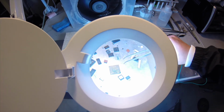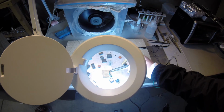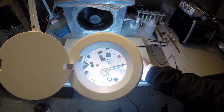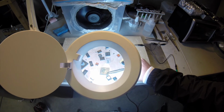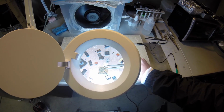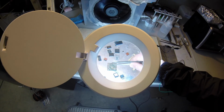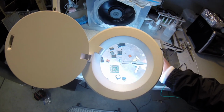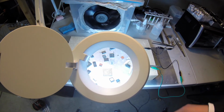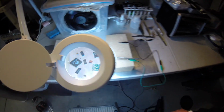Okay. So you see. Let's see how well. You can probably see it better now. That's a lot of solder smears. So I'm gonna try to get that off. I'm just gonna stick it back in the toaster oven, take it out, and then swipe a lot of the big blotches off, and then put it back in there and see how well that does. It should just form onto the pads, but then you'll get really small blotches, little streaks of it, and that's not gonna flow into the pad. But it shouldn't short out any of the little pads. So yeah, I'll go do that.